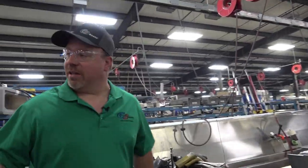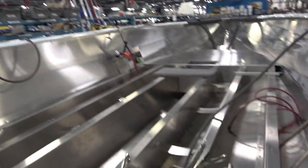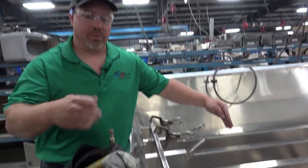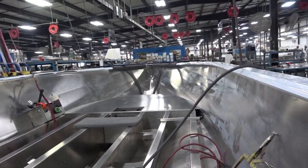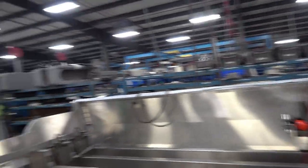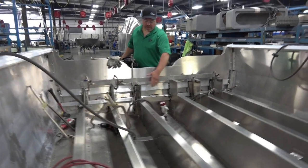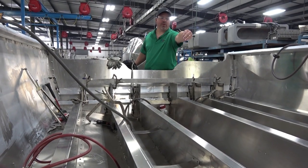After it comes out of the test tank, we know it's dry and it's going to be good. We put it on the production line. Here's where we start putting in the knee braces — they're welded in the back. We start our rear deck area; this is where they start looking like a boat. We've got our substructure up front, the floor is already down, and there's a series of foam stops and foam that go into areas to block off sections and ensure we've got drainage down the middle of the boat. These are set on 12-inch centers across here for strength, and the sub-bulkheads are set on 12-inch centers underneath that plate.